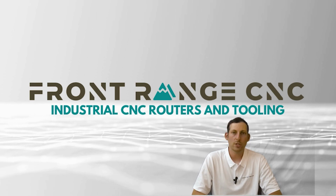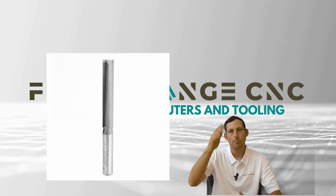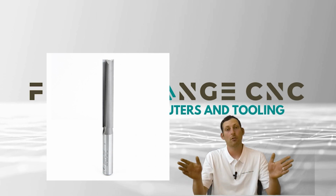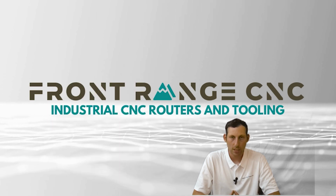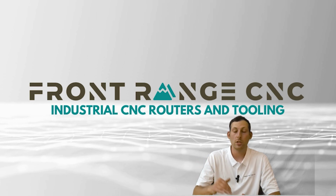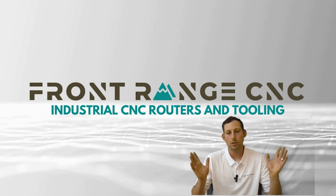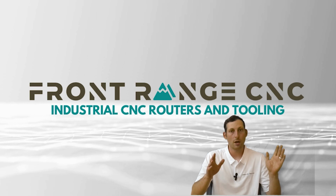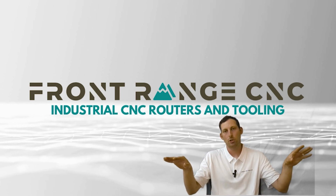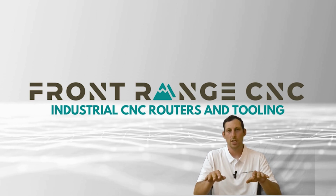The next style would be a straight bit. A straight bit typically, rather than pulling up or down, will pull laterally, so to say. So this is also a fairly safe pick in aluminum and plastic. As you start to get deeper in your cut, especially in aluminum and plastic, the challenge can be evacuating those chips out. In other words, on the first pass, it's typically tall enough that it's able to shoot those chips outward. But as you get deeper, you can imagine they don't have anywhere to go and they kind of get stuck in that slot.